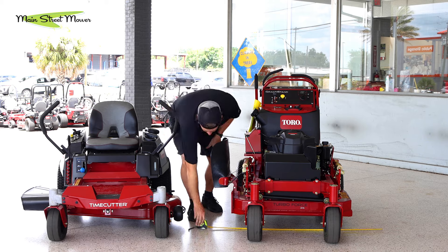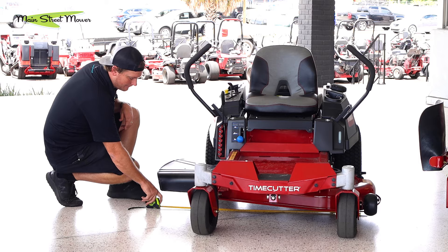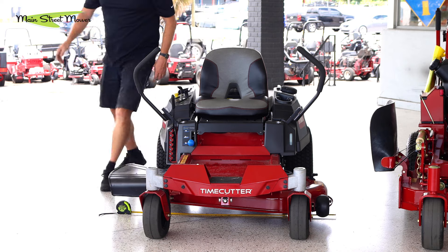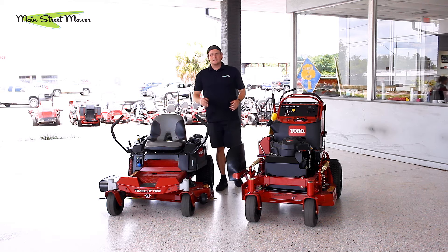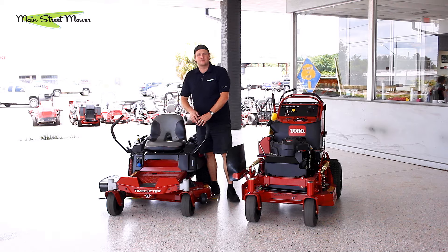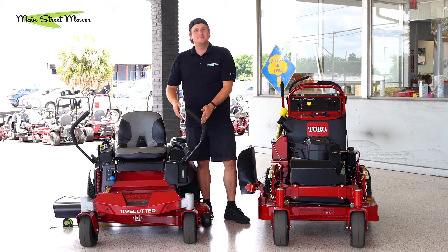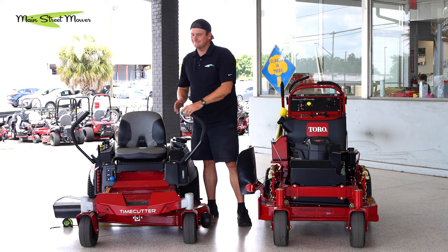Moving on to the 42-inch — this is for you homeowners out there. How big of a mower can I fit in my backyard? Here is the test. I'm going to slide this over, lock my tape measure. Giving myself a half-inch. Coming around here — if I fold this flap up, I am right at a safe 47 inches. This is the reason these flaps fold, so you can get them into narrow spots. I'm just teaching you guys that the number on the deck is not the number that it fits through — that is your cutting width. So 42-inch in this case actually means 47 inches, and so it can fit through a 48-inch gate, depending on how your hinge is made. Will it go through a 36-inch gate? Unfortunately, no.